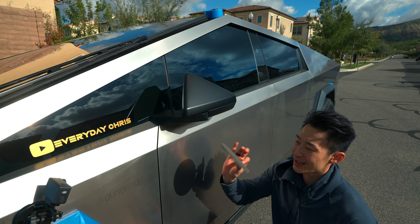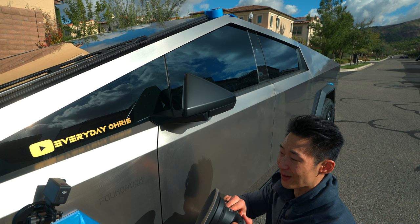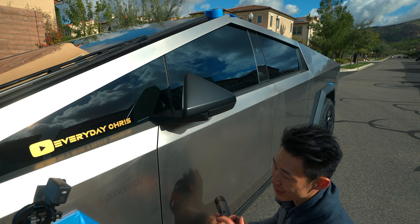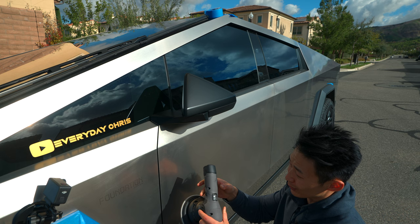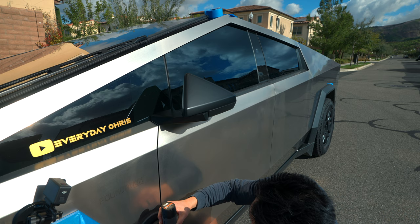We're going to use the 3M ultrafine disc first to remove the scratches, then finish with the Scotchbrite pad. Remember, very light pressure — you're almost pulling away from the panel because this does scratch it a bit more, but the whole point is to create a more uniform haze. Have it on level 2 to 2.5. You can wear a mask if you want, as it does get some stainless steel dust in the air.